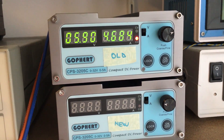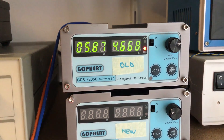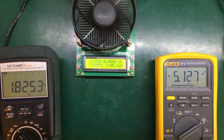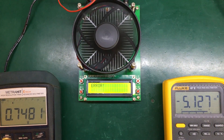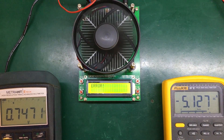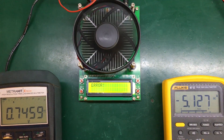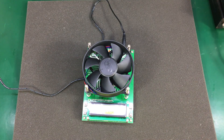During the test I also noticed a strange behavior — possibly a firmware bug. Sometimes the load would freeze, pulling 5 amps continuously, causing a weird switching visible even on my power supply as it hit the current limit and went into constant current mode. The LCD showed an error and none of the buttons responded; the fan was stuck on. The only solution was to remove and reapply power. These are the kind of bugs that could set things on fire.